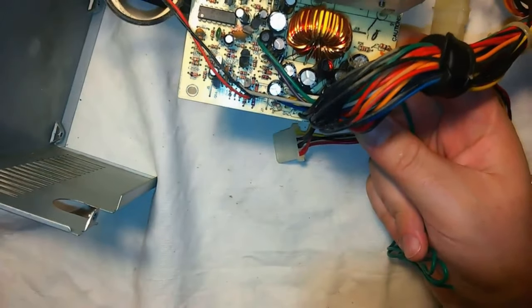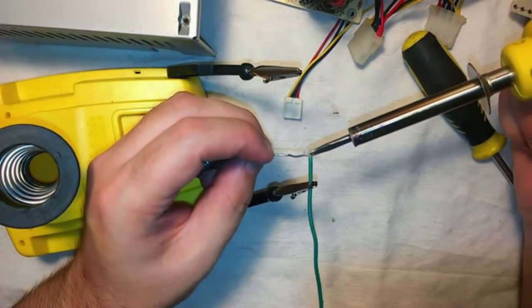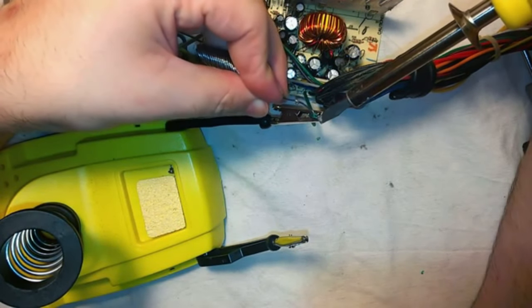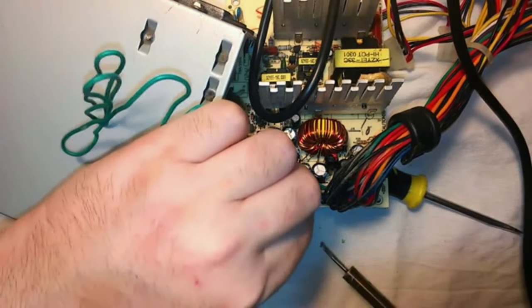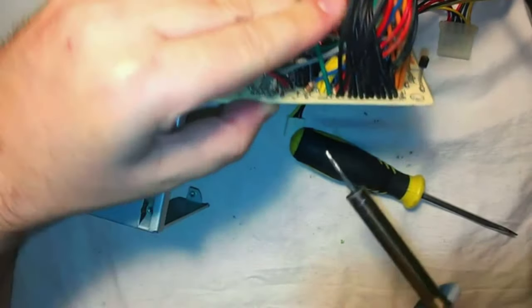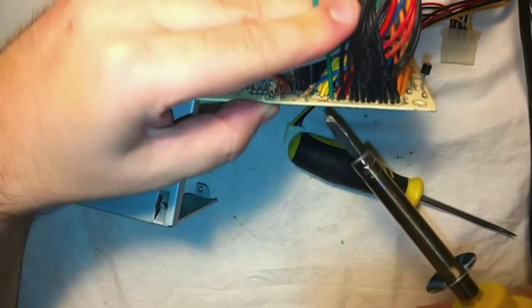After having disassembled the ATX power supply, I identify the number 1 pin of the integrated circuit on which to solder the resistor. I prepare the electric wire to be connected between resistance and ground. Solder the electric wire to a free mass. I solder the resistor on pin 1 of the IC, being careful.